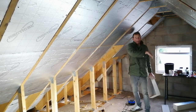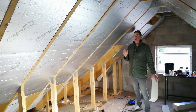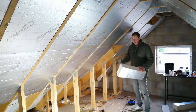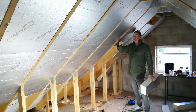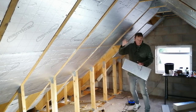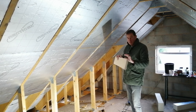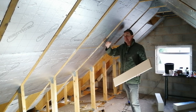The air can circulate over the top in what's called a cross-ventilated roof, and that helps prevent condensation and damp problems which could eventually rot the rafters. So in order to have a 50mm gap above the insulation, I've got 120mm between the rafters, and then on the face of that I'll also need 30 millimeters of rigid insulation bonded to the back of the plasterboard. This plasterboard here is only about 15 millimeters — I'm going to need double that thickness to make up the full 150 millimeters.